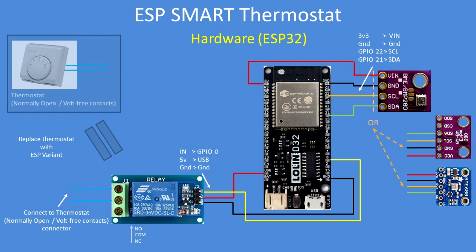So this is the wiring diagram. The sensor — three types of sensor available, all interchangeable. I connect those to the I2C bus pins. Wire up the relay and connect the relay control to a GPIO pin — I've used GPIO 0 in this example. And the volt-free contacts of the relay go to the high voltage control lines for a heating thermostat. So take out the old thermostat connections and replace by the two normally open volt-free contacts of the relay.